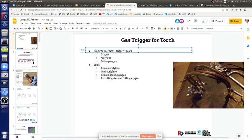But the acetylene you still need, but then again, in a future iteration, it's hydrogen. Hydrogen is far superior to acetylene. Like Brown's gas. The idea there is it doesn't carburize, doesn't harden the steel. The carbon in the acetylene is good for what we want to do for the blades, because it actually hardens the blade tips. Hydrogen would be worse for our purpose, because of the hardening of the blades. So you'd have to start with harder steel to get an equivalent grinder, shredder.